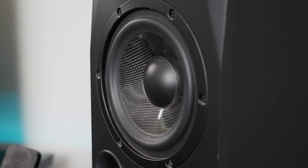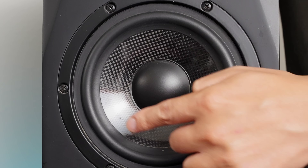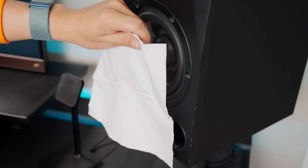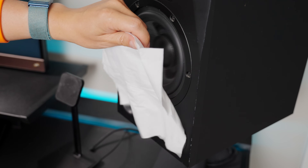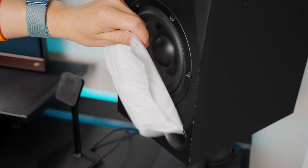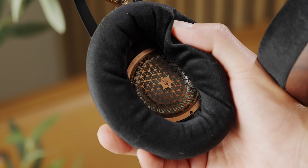That's where air conduction comes in. It differs from bone conduction as it relies on having an enclosure or surface to produce vibrations. This is most often found and referred to as the cone or diaphragm on a speaker, and that's the largest area of a speaker. What's neat is that making these components vibrate literally moves air that eventually enters your ear canal, reaches your eardrum, and in turn creates waves in the liquid found in your cochlea — hence the name air conduction. You can get an idea of this when you're at a concert near the subwoofer and you feel the air being pushed out with the beat, or you feel your pant legs shake while listening to music in your car. This is the method of most headphones, earbuds, and speakers, and it's much better at producing low end frequencies.